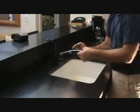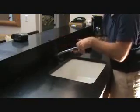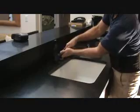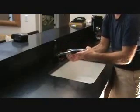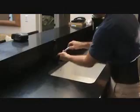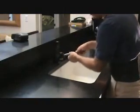And sometimes incidentally, you got a leak underneath your kitchen sink. You're not sure where it is. Sometimes it can be coming right from here. I've had this happen before, and a lot of times you won't notice it because this is pushed down in here, and just this faucet end is coming out. You could be leaking all the way through here, not even knowing it.